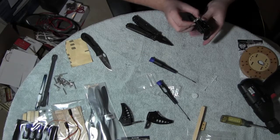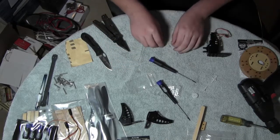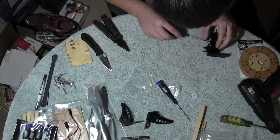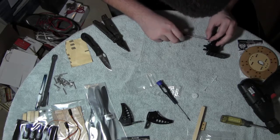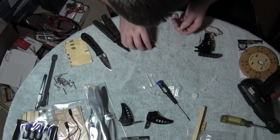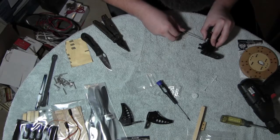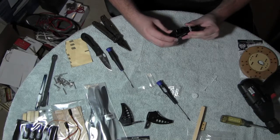So servo's centered, the tilt mount is centered, so I'm going to take these two screws that came in the tilt mount kit and screw those into the push-pull mounts. If I can get the screw to stay on my driver. Alright. Now if you want, you can go and Loctite these. I will not be Loctiting these. I feel like they should hold strong enough. Chances are I'll probably go back and Loctite them after probably the third flight if they happen to be vibrating loose.